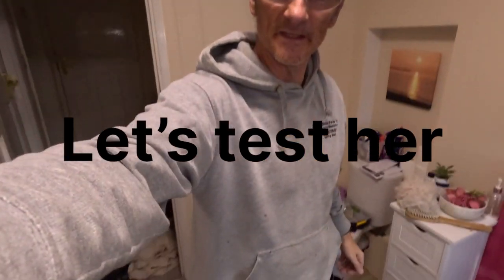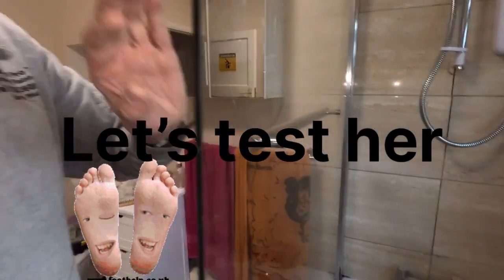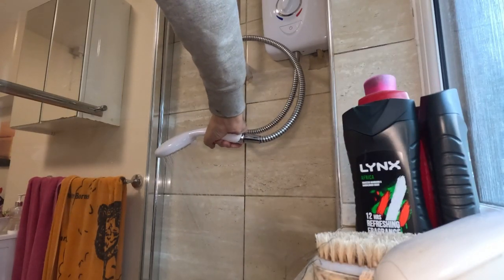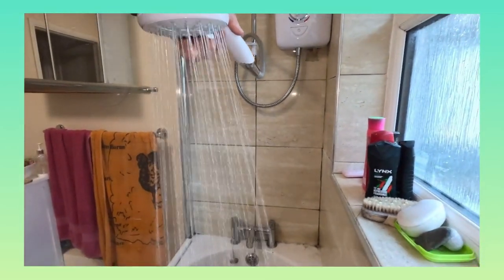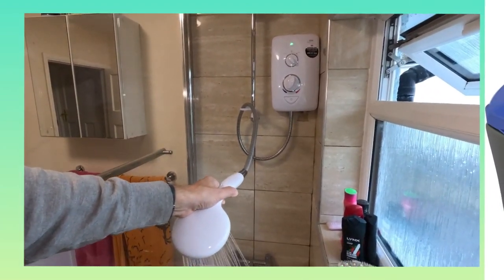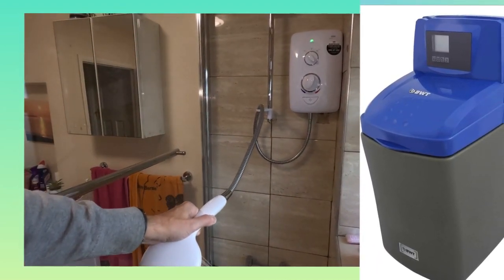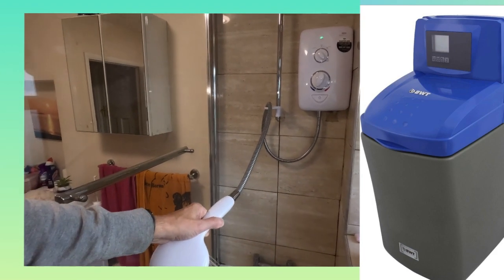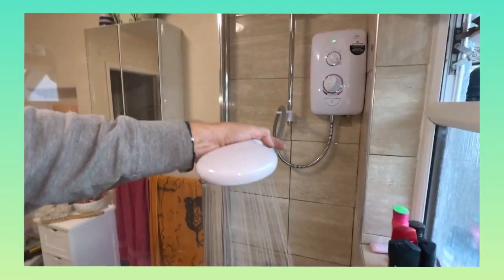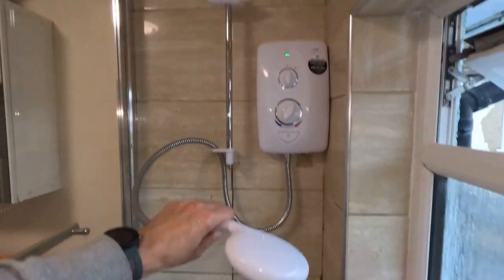Right - for this I had to take my socks off. We've got a fixed screen here. Let's test it - it's cold. Running that for a bit - good pressure. In Oxford you need a water softener because this is great but in a year or two it'll start to crud up. I fit BWT water softeners which are amazing - five year guarantee. That's running through nice, flushing through cold water. Now start warming her up - the element's heating it. All lovely, all working.